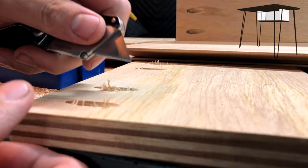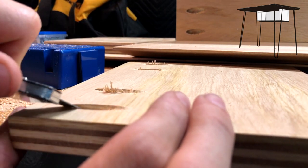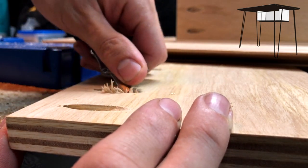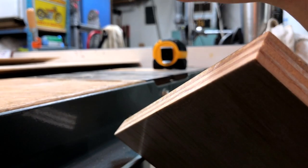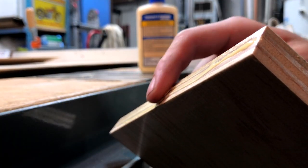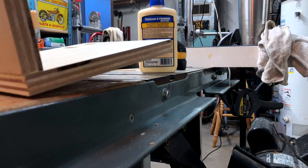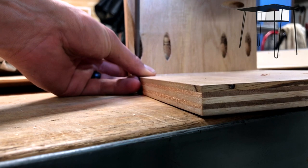You really should use a sharp chisel for this, but I just used my pocket knife because I had it close and handy — it worked okay. All we're really doing is cleaning up those edges so we don't have all that tear-out in there. I also used wood glue on all the joints where I'm putting pocket screws. After you lay down a bead of glue, smooth it out with either a brush or your finger to get good coverage across that whole surface so it's evenly distributed. Next we're ready to line up, square up all our edges, and start putting our pocket screws in.